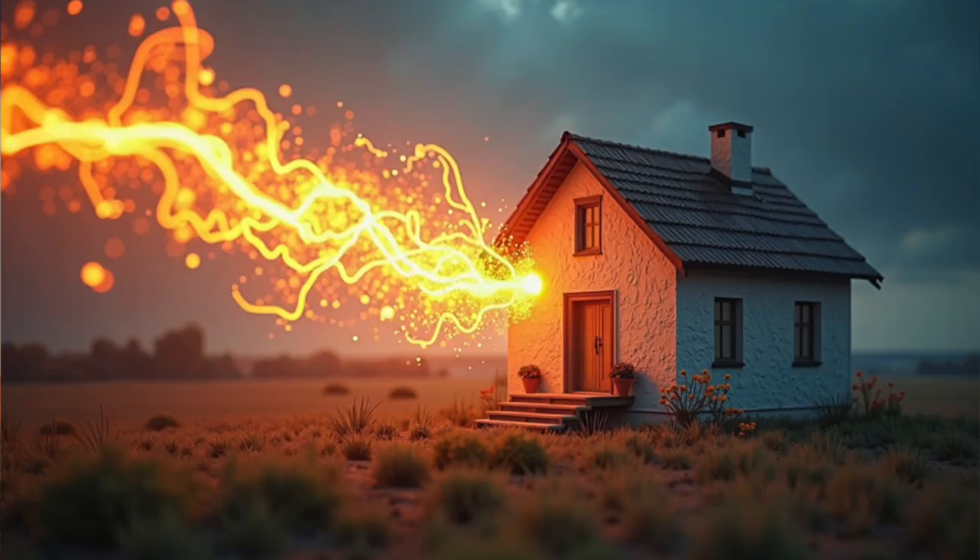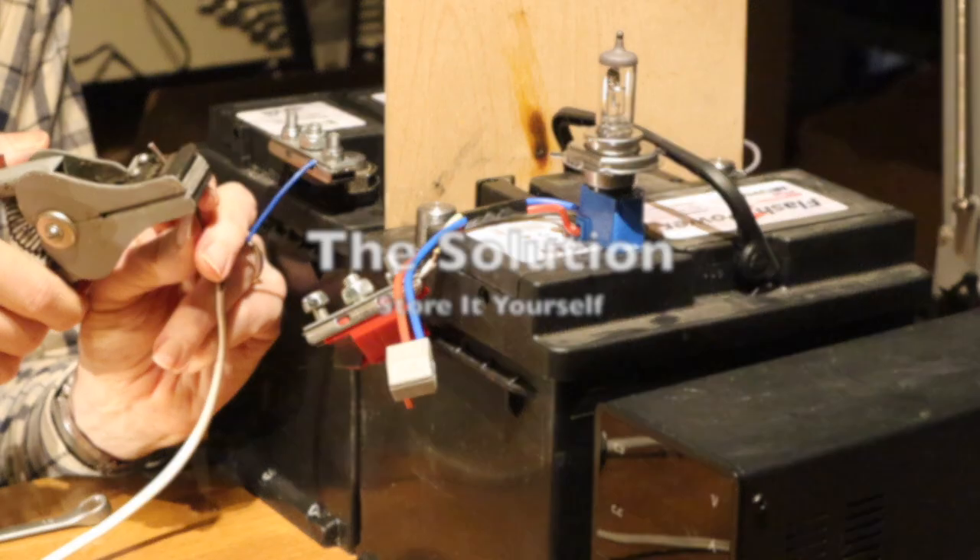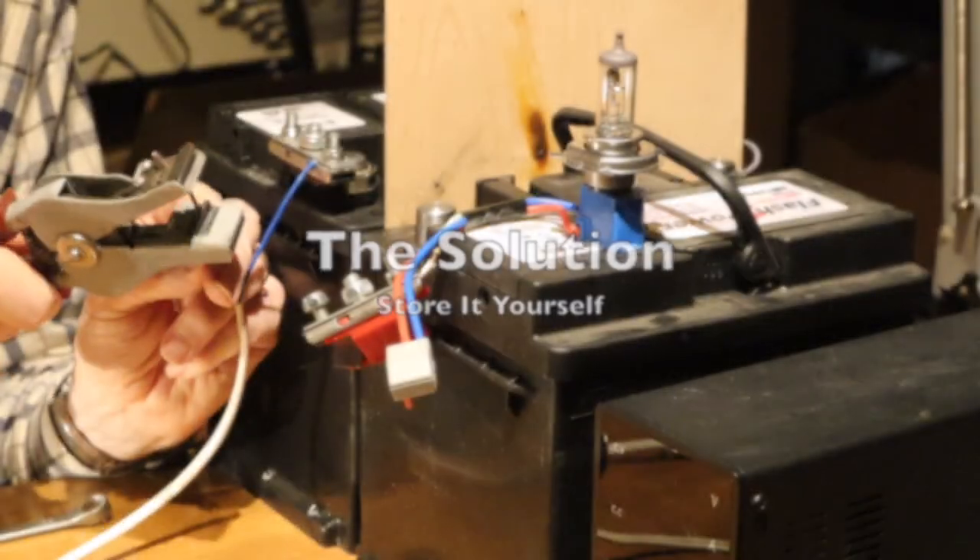Let's catch that power before it escapes. Most micro-inverters can't store energy, but I've built a safe DIY system. It stores solar in a battery, and later — or also in the moment — you feed it into your house when you need it. You control it with a manual switch for now. No unwanted feed-in into the public grid. But you must be there to flip the switch if there's no consumption. In the next videos, we will make this automatic.